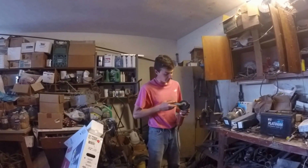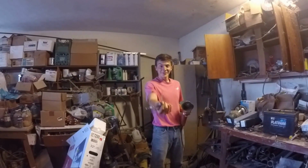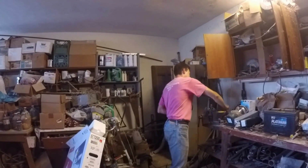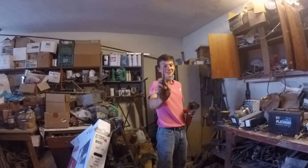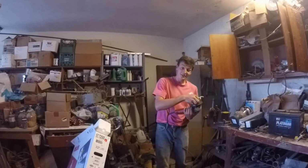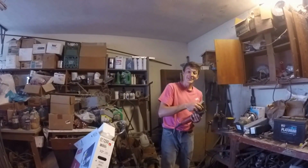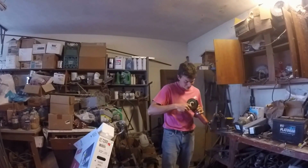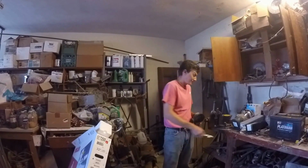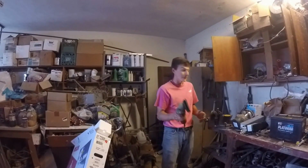We have a handful of blades for the grinder. We finally found these glorious chop blades. They're very thin, and they cut through metal 3 times as fast as one of these thick guys. And it took me all my life for Dad to finally buy a couple of them at Rural King. It's the greatest thing ever. We can cut through any chunk of metal, rebar, slab of steel, plate, and do it quick. And these thick ones are really just for finish grinding.